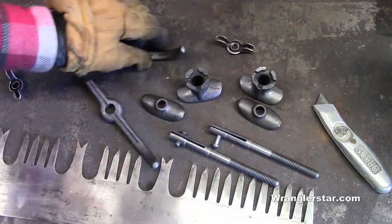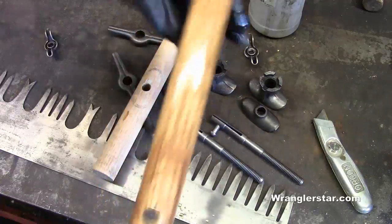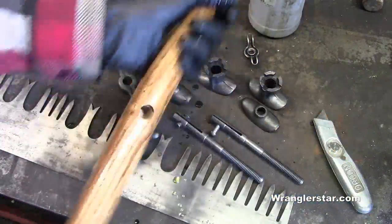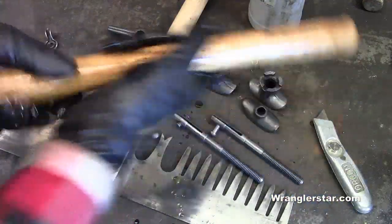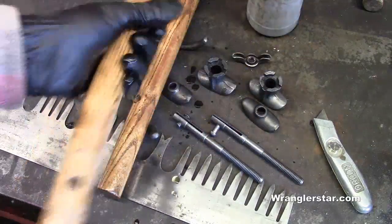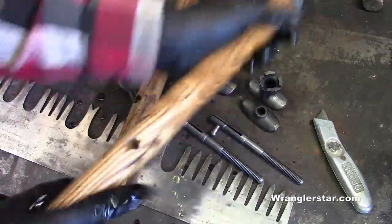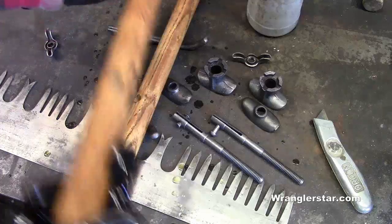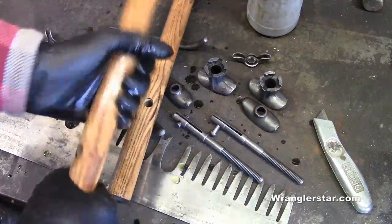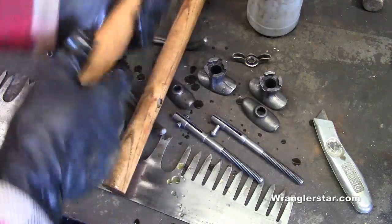Let me get the handles linseeded up and we'll put it together and see how it looks. Having the original handles — how unusual is that? Never even heard of that for a saw that's 100 years old. For my prep, I like to start with a 180 grit, sand it real good, and then finish up with a 320. That seems to be just about right. Gives you a nice bit of grip with certainly no slivers, not going to give you unnecessary blisters. Nice bit of hickory there. There's something special about working with these tools, having my hands on these handles that my ancestors used.